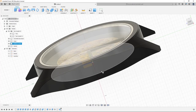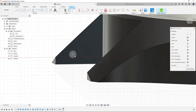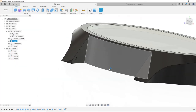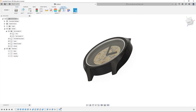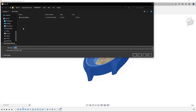If you did want to add holes, you could just hit C, select the face, pull through, and you have a hole — repeat for each side. So there you have it — we have a watch done. If we wanted to 3D print it, we'd go to the utilities tab, click make, select the case, uncheck 'send to 3D print utility', click OK, and it would save the file as an STL. Then we'd load it into our slicer software.